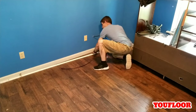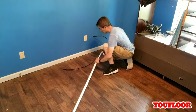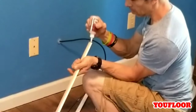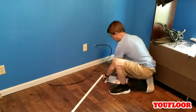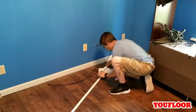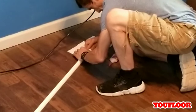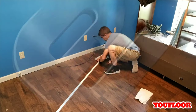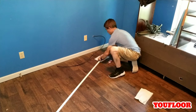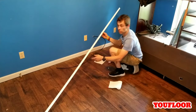They don't sell this at Home Depot or Lowe's, but you can find exactly what I'm holding on Amazon — they've got it in a little spritz bottle as well. So we have our two pieces — the splice is at 44 degrees on each end. I'm just going to take some CA glue and squirt it on there nice and generously, then spray the accelerator. I'll count to 10 and it's cured rock solid.